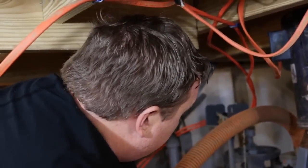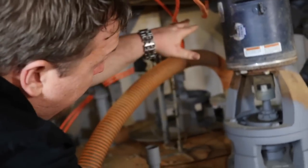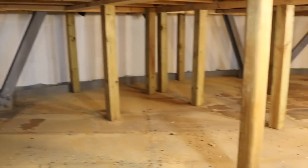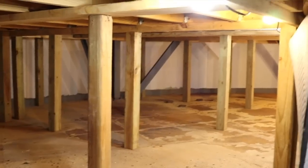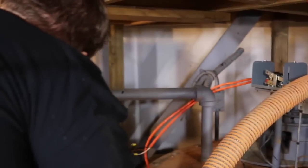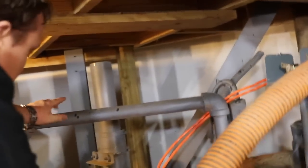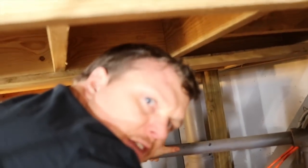We have another pump down there that goes through this orange hose, and this orange hose is just tucked in this hole — that's where the septic waste plumbing will go. So all the waste from the kitchen, which is to our right, will come down here. That's where the kitchen plumbing and electrical will all come down and waste into here. This is ventilation back there — that's actually copper, so a lot of that got taken. That vents this tank. One of the challenges is we have to vent that somewhere outside — still haven't quite got that figured out.